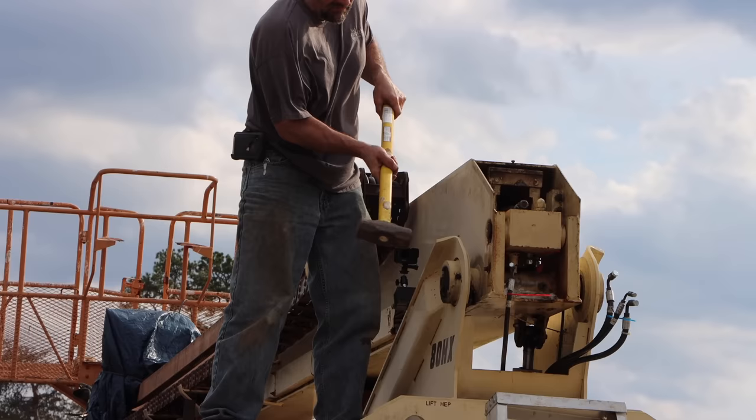I think I hear the relief valve. Nice, oil's coming out there. Do I just need to tighten that? Alright, that's it. Now we will crack out the oxyacetylene. I think I'm going to put some damp rags over these areas and heat all through here. And hopefully that thing's going to pop with all that pressure on it.